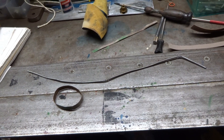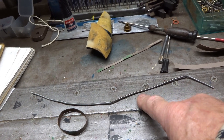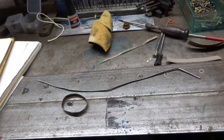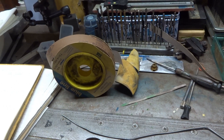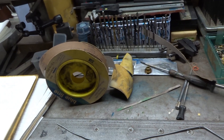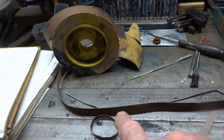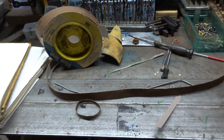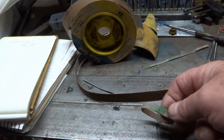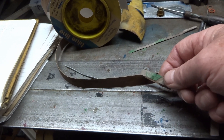What I'm attempting to do for this nodding donkey engine is to get rid of my cobbled-up, rather naff-looking sort of elasticated spring-steel drive band — the sort of thing you get on a Mamod — which I never think looks very good. I have a roll of 400-grit sandpaper, and I've cut a length of that off and trimmed one side down to about five-sixteenths wide. I had a tester by gluing the ends together — this is just a scrap piece — with super glue, to see if it'll hold together, and it does and you can't pull it apart.